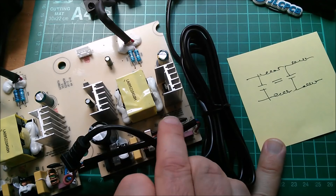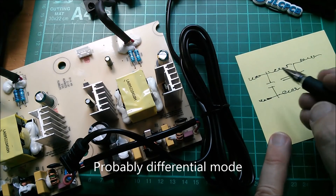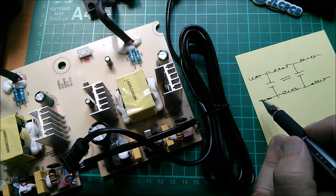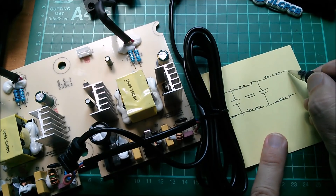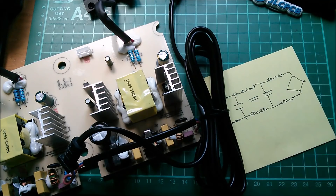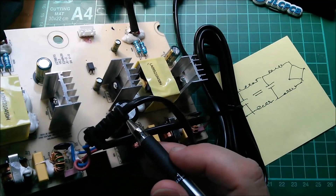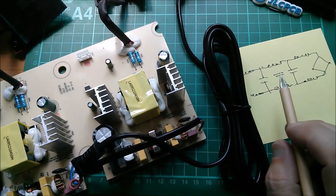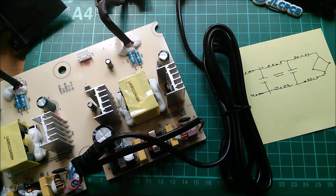If this little toroidal transformer is also a common mode choke, you've got inductors here, and in one arm you've got the fuse and in the other the NTC thermistor — the thermistor is in neutral, the fuse is in live. Over this end we've got the diode bridge where AC is turned into DC, with the ripple taken out by the large high-voltage capacitor, which in this case is 68 microfarads at 400 volts. That's a pretty extensive mains filter network, which is good to see on a budget charger. I think this was about 20 pounds, £19.99.